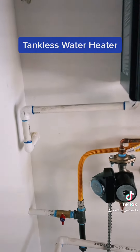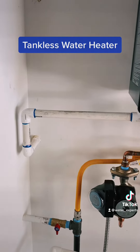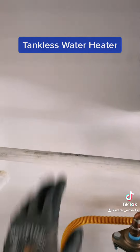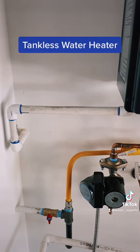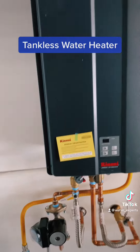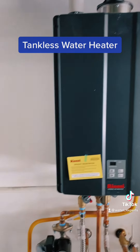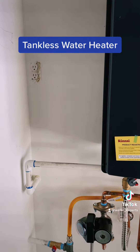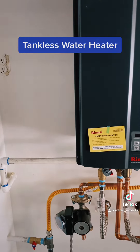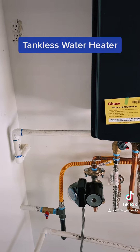A lot of times for these gas water heaters you'll need a neutralization valve or filter, which would usually go about here, but since it's just pouring into some rocks outside we don't need that. The gases build up condensation, which can cause problems to concrete or anything that needs to look nice if it's pouring onto it, or if it's going into pipelines it could destroy them — so just keep that in mind.